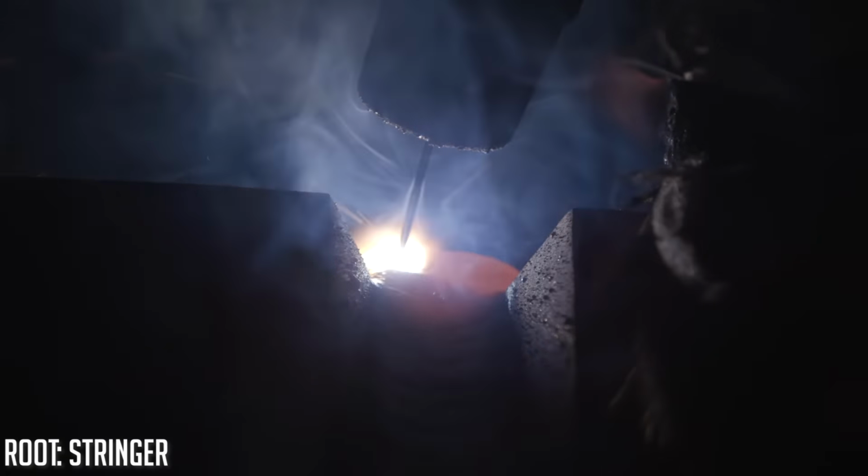One thing I do wanna mention, this weld right here, and I anticipate this one's gonna do it as well. This side over here on my left, your right, is a little bit lower than the side on the right, my right-hand side. Your left as you're looking at it at home. What I can do to fix this is rotate the plate or weld with my non-dominant hand. So right now I'm welding left to right. I could switch over and go from right to left. That's probably what I'm gonna end up and do.